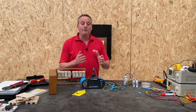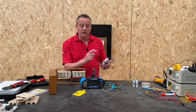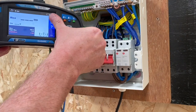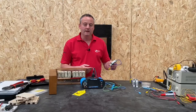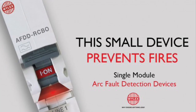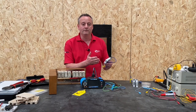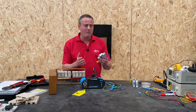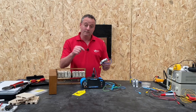With my Metrel 3152 multi-function test leads this leads me into the next great feature of the AFDD — it's two pole. When I operate the mechanism it disconnects both line and neutral. Therefore when carrying out your insulation resistance test from the top of the device, it means you won't pass that high voltage back through the electronic components within the device itself. So this AFDD offers protection against serial and parallel arcs reducing the risk of fires, earth leakage protection via the built-in RCBO, as well as short circuit and over-current protection. Our friends over the pond have had this technology for almost 20 years — I'll be really interested in your comments on whether the AFDD is where we're going next in the UK, so please comment down below.